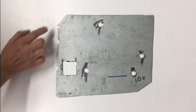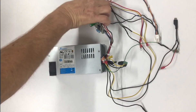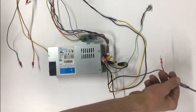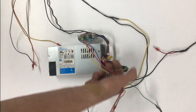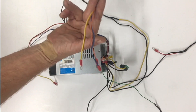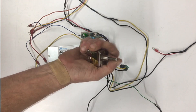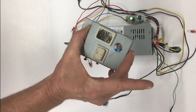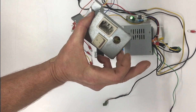This is 16 gauge sheet metal with holes drilled out so I can have wires on the back. There's a sound hole and here is our modified Seasonic power supply. If you look, there's power for the Raspberry Pi, our common and on wire power for the fan, and our positive 5, negative 5, and positive 12 that go to the LC-475. Now these are going to connect to a double throw three pole three position switch. Here you can see where I took the end of an original power supply and cut it off where I could keep the original power switch and plug wired in a cord. And there's a cutout for our three pole switch.